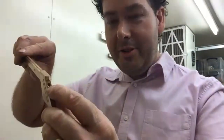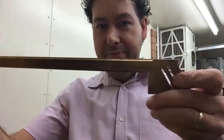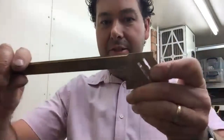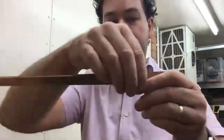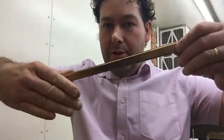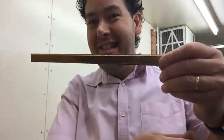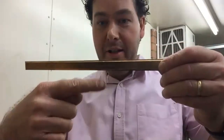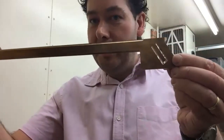And then this screw is released, which leaves the blade under constant tension along its length, as well as pulling the tooth line. Now that's different from conventional saw tensioning, which is where you're just relying on a friction fit on the back, kicking up once it's assembled, pulling the tooth line. Now, if you put the tooth line in tension, you actually put the upper part of the blade in compression. This actually does both. So it pulls the tooth line as well as pulling the blade.